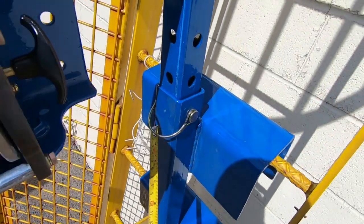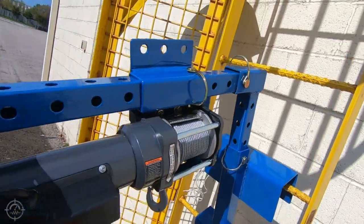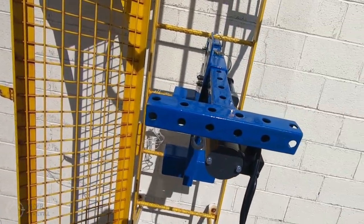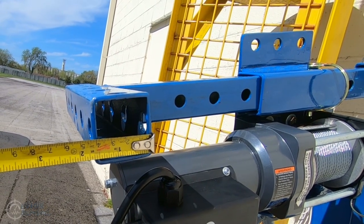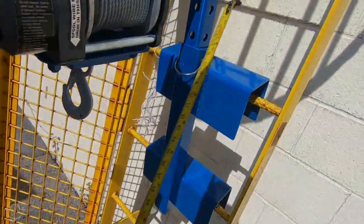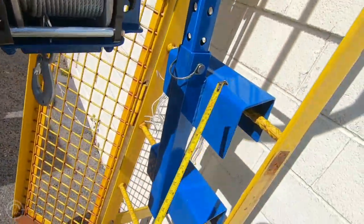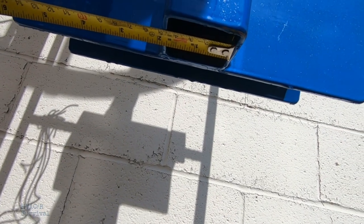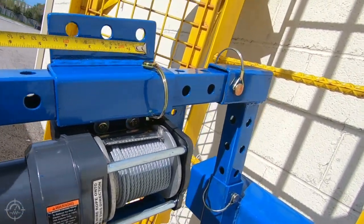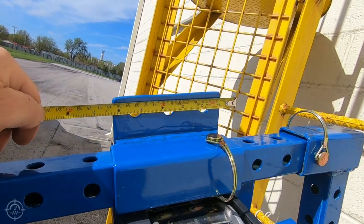The base tubing is where you'll have the hardest time finding inside/outside tubing dimensions. Most people don't want to sell to you because you're not buying a lot of metal. It measures at an inch and five-eighths squared. The tubing here and here is exactly the same all the way along. The inside diameter measures about an inch and three-quarters, and on the plate up here I spaced them out right at about an inch and a half separation.